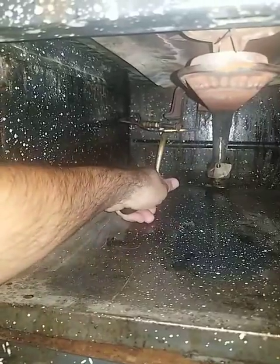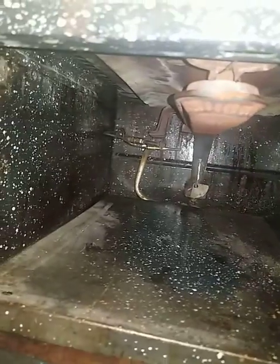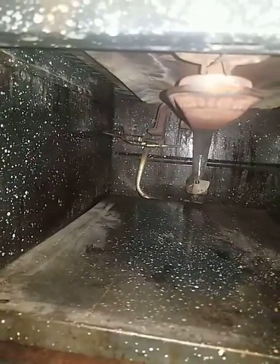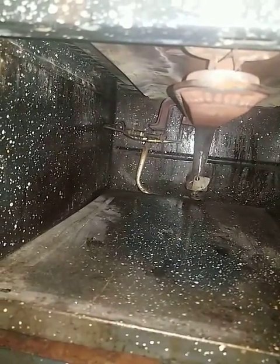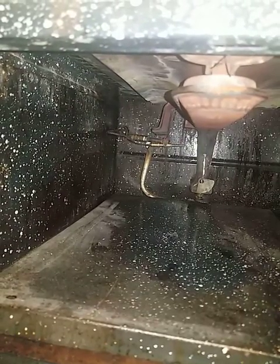When I took a lighter and heated the probe and then came up here and turned it on, it worked, but then it turned itself off. I reset it again and then saw that it wouldn't turn on. So the pilot wasn't heating the probe enough.